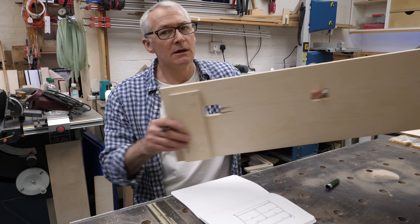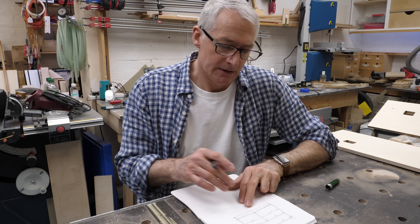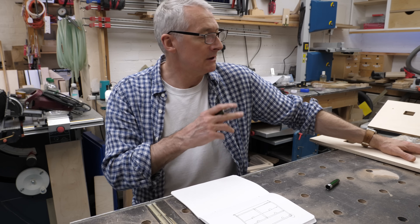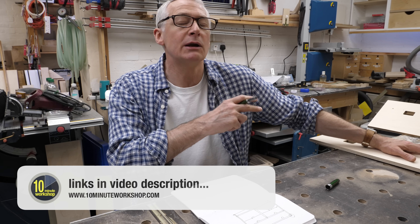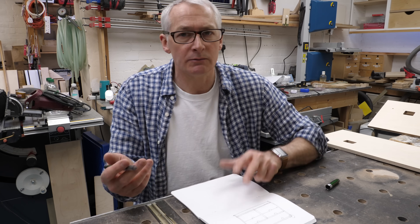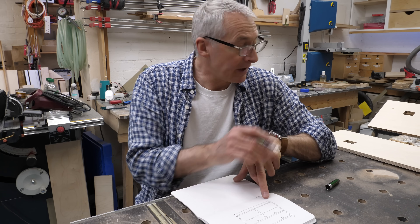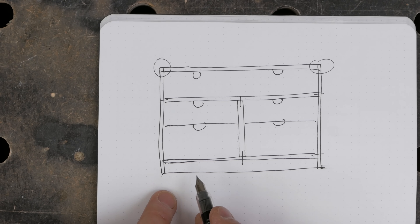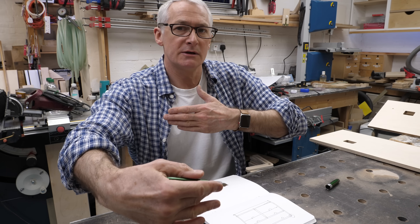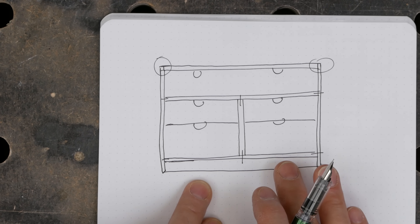Now this isn't a complicated build but it is a little bit finicky, because the only joints I can use the fence on are the two top corners where they butt together. All the others are going to be mid-panel joints, so a little bit of careful marking out to do. That's why I've made this mid-panel jig as well for my peanut cutter. I'll make that video available as a public one — there's a link in the description so everybody can have a look. The only part I won't be able to use the homemade jig on is the plinth, because that jig is designed for the depth of the carcass whereas the plinth runs across the width, so I'll have to use the Intelligent Fixings mini jig for that one.